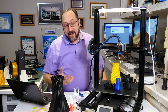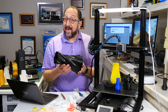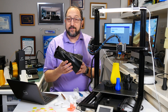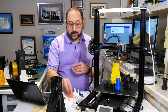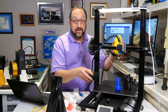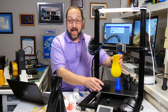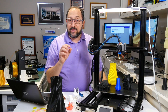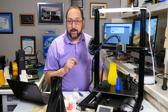When printing at slow speeds — and that's a caveat — I find that printing at a base speed over 50 millimeters per second, the quality on this printer suffers. However, at slow speed the quality is quite nice, really quite nice. In fact, the first layer quality is as good as any printer I have, with the exception of my Prusa, which is a little bit better.